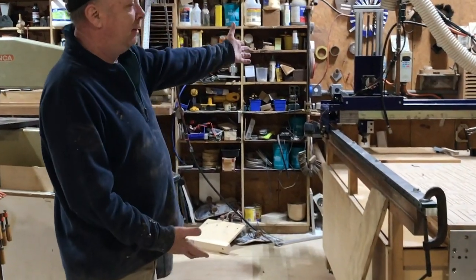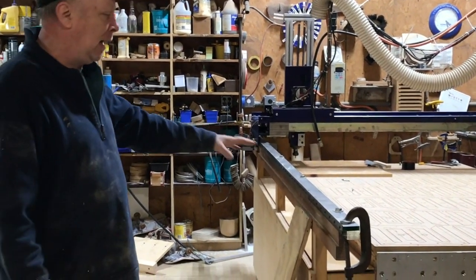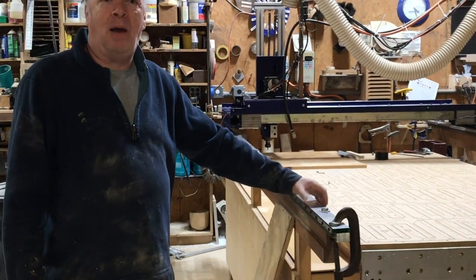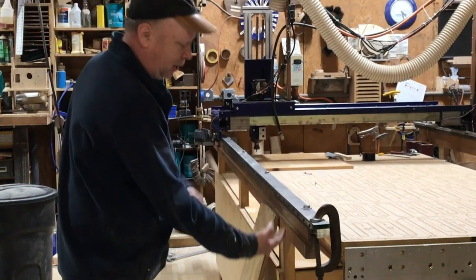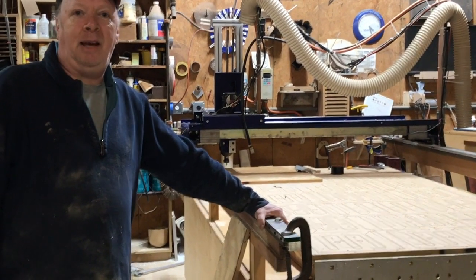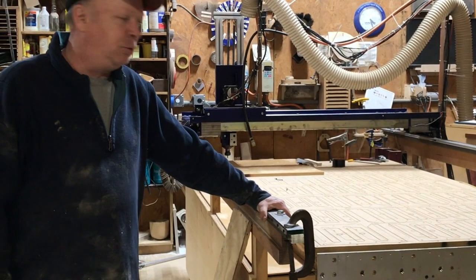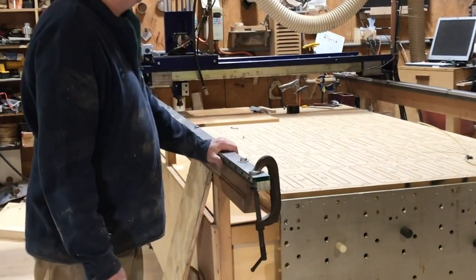All right, so here we have the Shopbot. My Shopbot looks very different than the ones at NextFab. This guy is 18 years old. When I bought mine, you had a choice. You could buy just the machine or the machine with the table. I opted to make my own table. This is actually the second iteration of my table. The first one I made out of extruded aluminum, and it was too wiggly. So this is solid maple with mortise and tenon joints and plywood on the sides, very stiff.